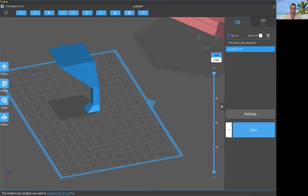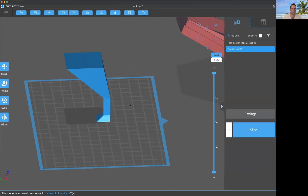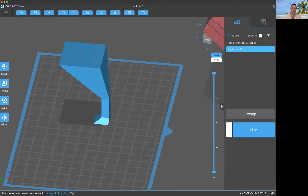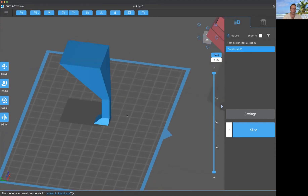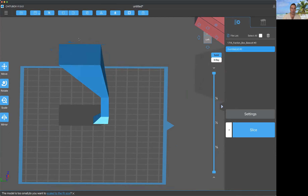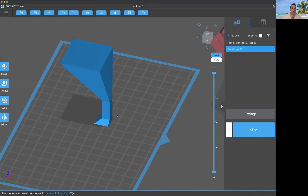I whipped up a random shape in Blender to point out some ideas. In this orientation, there would be a small connection to the plate, which is not good, because the connection to the FEP would be very large. So you'd have a strong pull from the FEP versus a weak pull from the plate. Even if there are no islands in this orientation, either the FEP force pulls it off, or you encounter torques — when you're supported on only one side, you have to think about torque and leverage and counteract those forces.